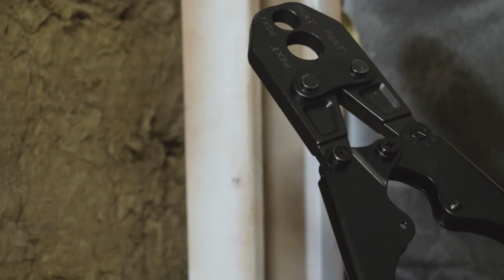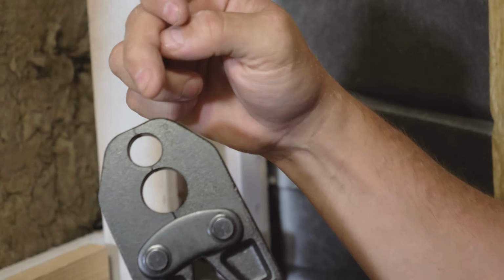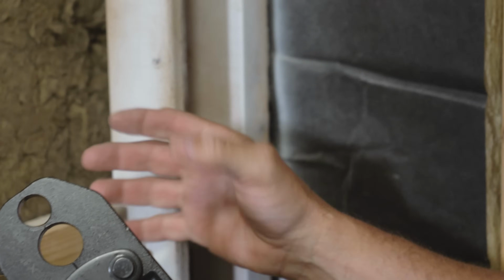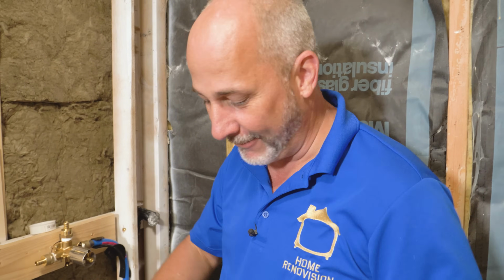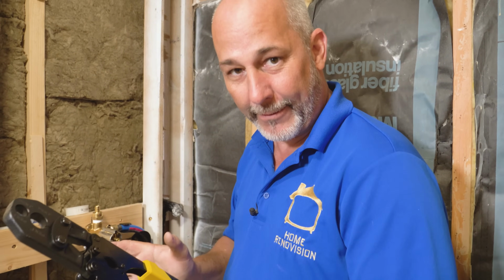Okay? See that? That's closed. That creates the compression that shortens up the diameter of that ring. And the water pressure alone is never going to be enough to make it force expansion again. Okay? So that's plumbing. That's done. It's guaranteed. Every time you get that sound, you don't even have to wonder if it's going to work.